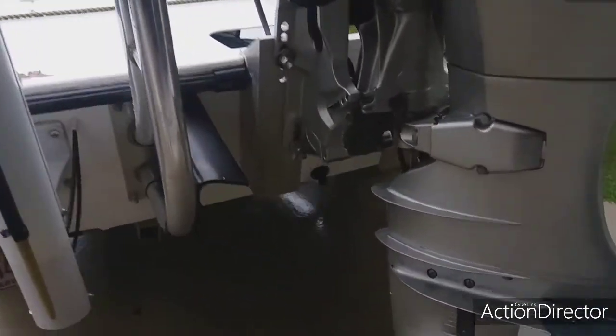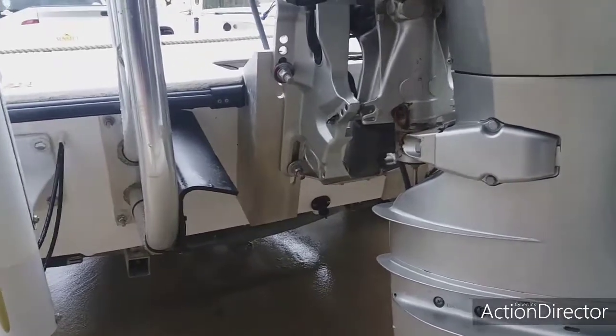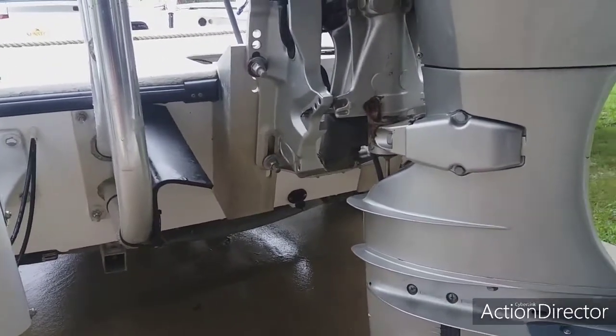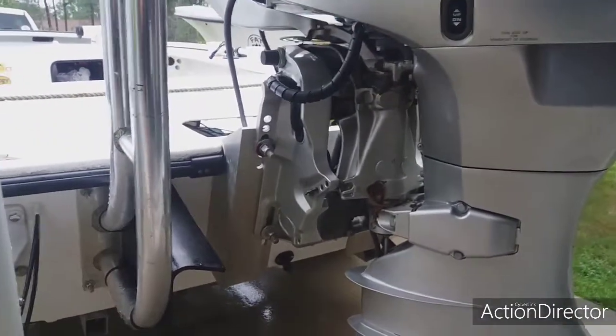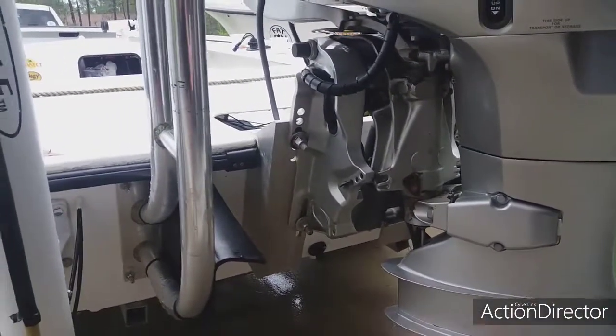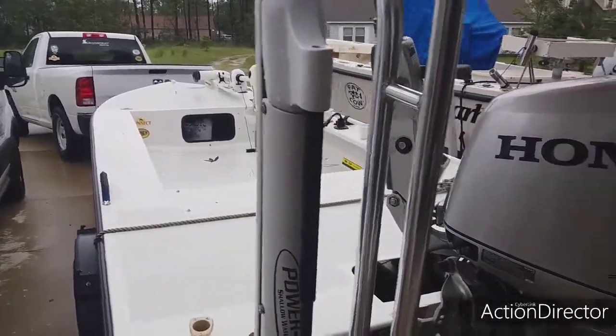So on this type of boat, you'd want to pull your drain plug so that it's draining through that the entire time. Your battery stays good, it's always ready to go. You can come right out, see the water level coming up, and if you've got to go, just screw the drain plug in, untie it, back it out, and go.